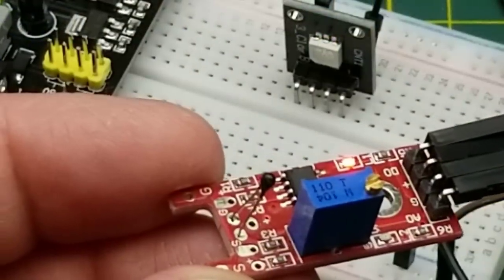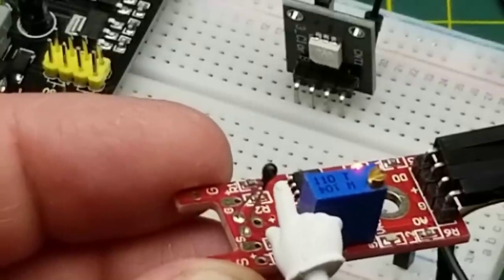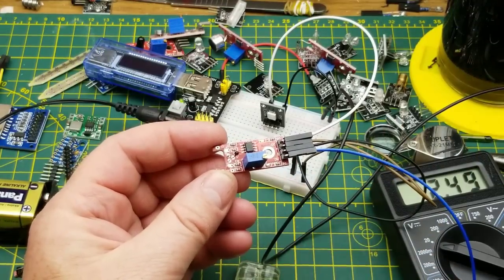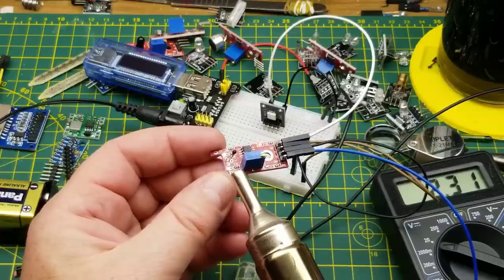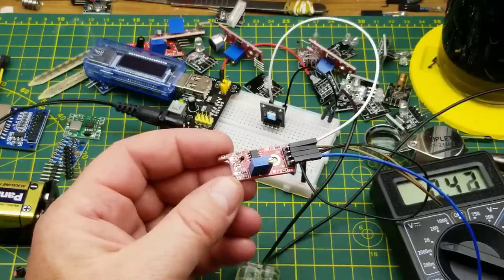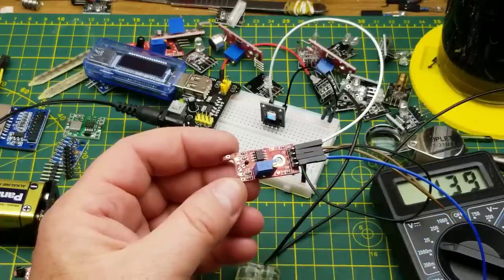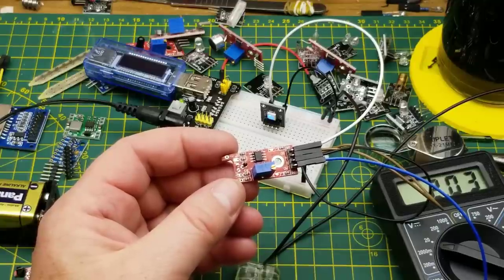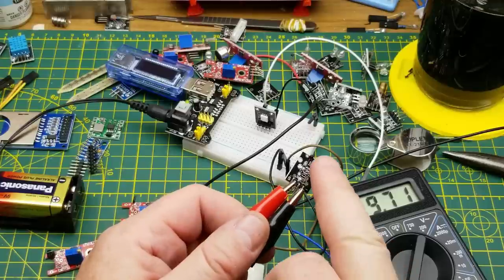This board is one of several temperature sensors in the kit — an NTC thermistor, a resistor whose value changes based on temperature. Like all the similar boards it has a threshold. If we warm it up, watch the analog value changing, and it crosses the digital threshold. When it cools off the threshold un-crosses again. You can calibrate that if you choose to.